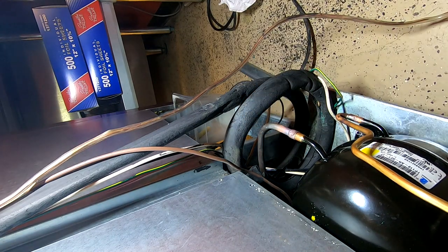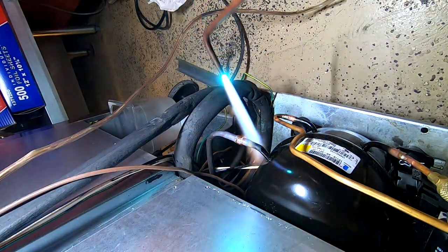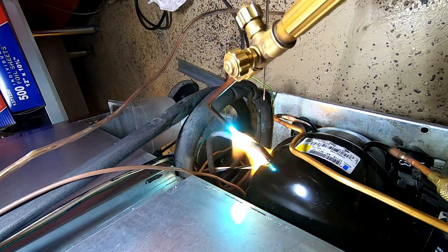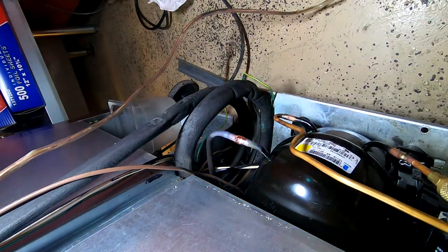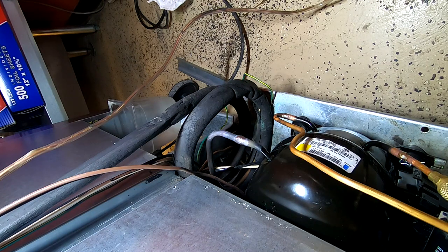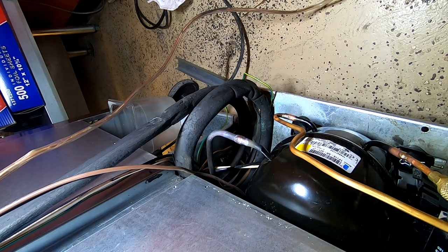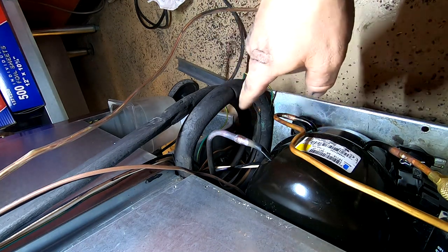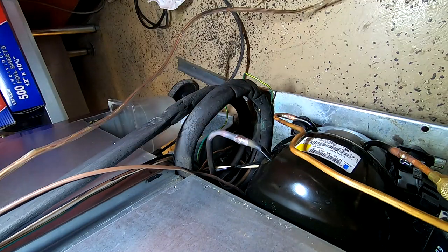I got it all in place and then killed the nitrogen right after, then hit it one last time just to warm it up and make sure no nitrogen was blowing holes through it. Even though it's super slow and not brazed over, it could cause back pressure and blow it out. When we bleed through here, this pushes through the suction side — from here to here is wide open — so it goes through and out to the coil, and you're also going to get some back here to where the filter dryer comes out.